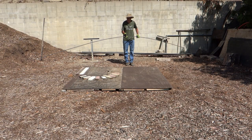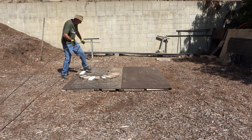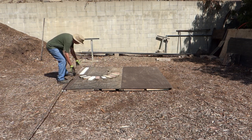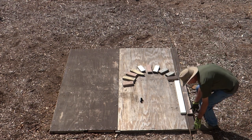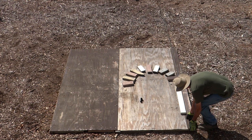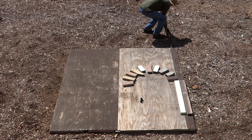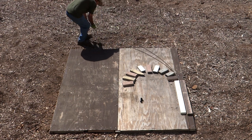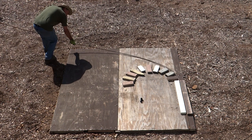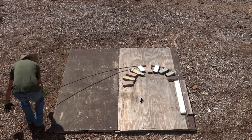So the first thing I do is get my 20-foot length of rebar, lay it down in my jig, and make sure that the end is level with the plywood. Then I grab it somewhere in the center and work my way around — just bend it around, and as I move along, I'll work further out.